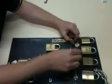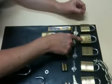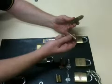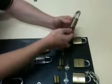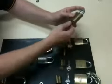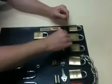There was also a need at that time for key retention, hence we moved to the 245-50 padlock, which was a heavier-duty style padlock. It had a unique plug that only fitted this style of padlock, and you'll notice that I can't take the key out without the shackle being in the locked position. That stopped padlocks being unlocked in the field.